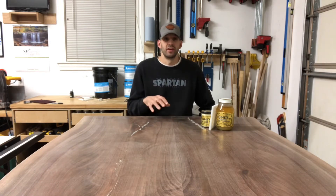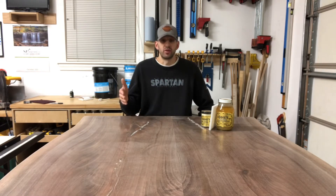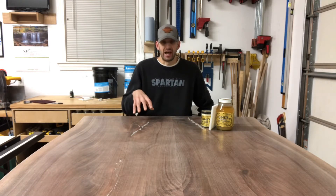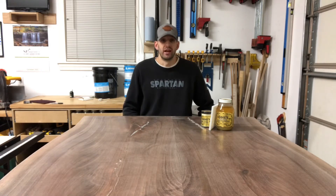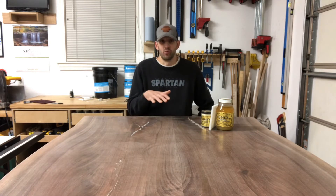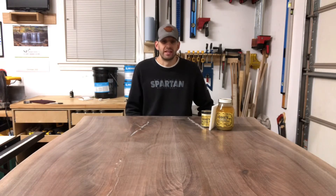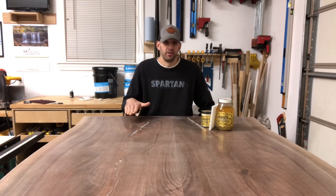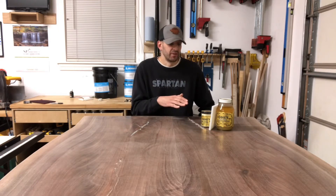The next part of this series is applying the finish to the table. To recap: the underside was finished from 120 to 240 grit, not skipping any grits. The top side was sanded from 120 to 1000, also not skipping any grits. Because of the figuring in the wood, the first round of sanding was done by Rotex on the coarse setting, which got all the scratch marks out.